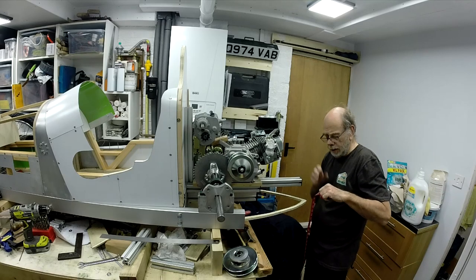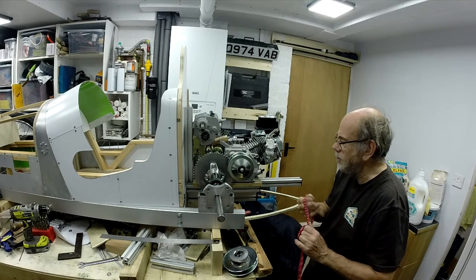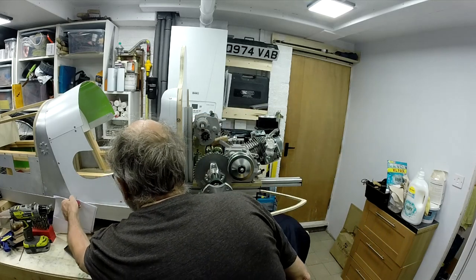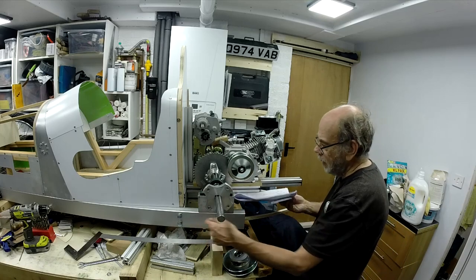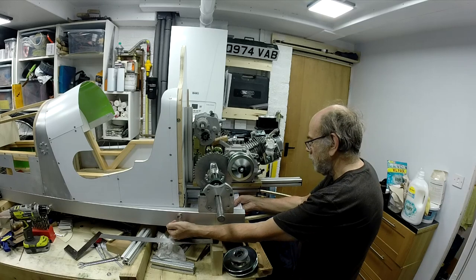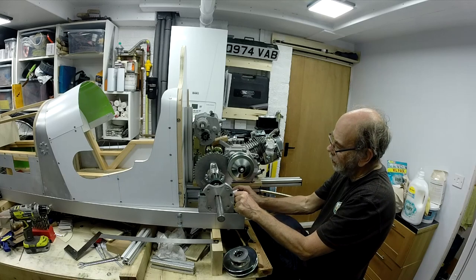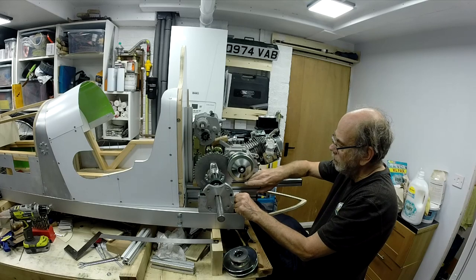I've got room for the disc brake on the other side. I think there's plenty of room there, and I'll just put another upright in there and mount the bracket off that. What I think I'll also do then is put in some ducts that will pick up, drop just below the frame rail in there, probably, I don't know, half an inch, three quarters of an inch, something like that, which will pull air in underneath. And if I curve those up virtually around the chain and bring them up to there somewhere, the ducts either side,